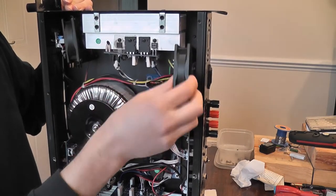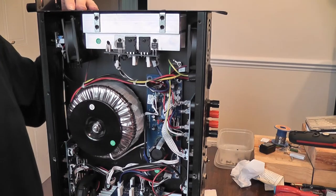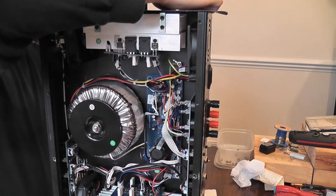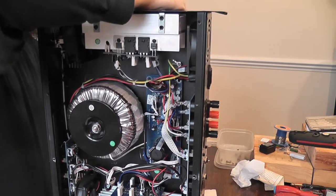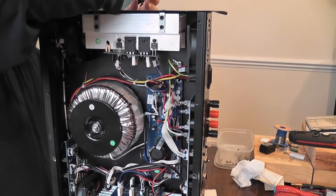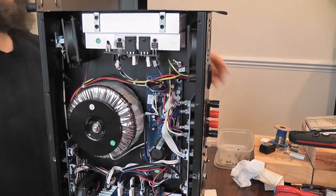They've got mastic stuff on them and this is the butchered one, so there's only two Molex connectors. Then there's just five screws at the bottom of the heatsink which have to come out. They're not particularly tight - it's quite nicely done actually. I've had years ago a load of cheap Skytech amplifiers, very similar construction but done in a far cheaper and less effective manner. It's five screws at the bottom and two screws on the side of the heatsink.